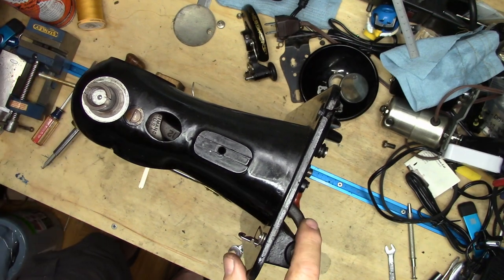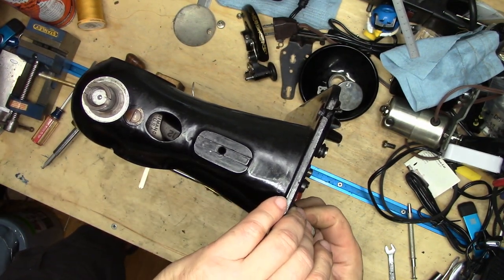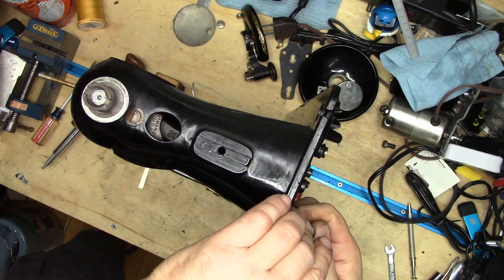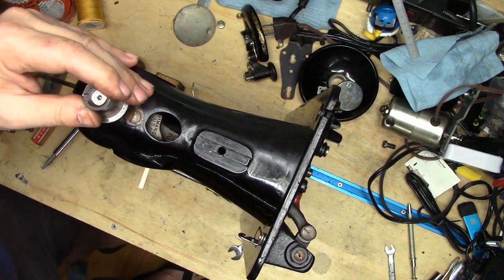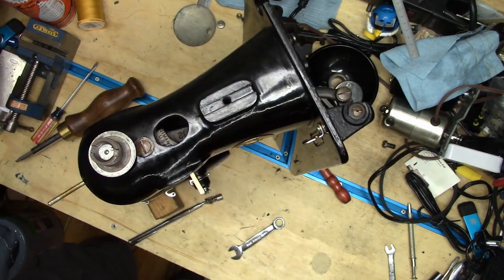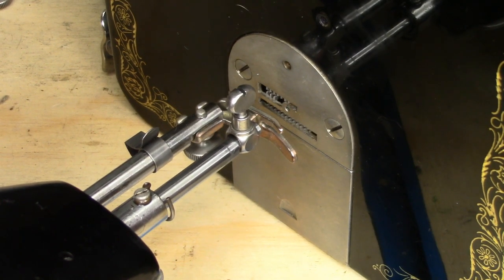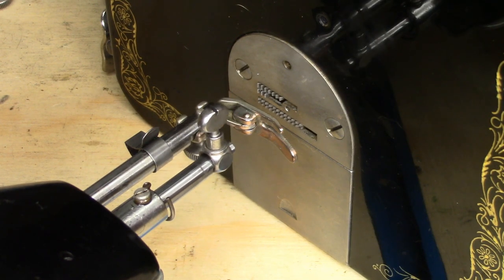All that's left is to make the normal adjustments for the fore and aft position of the feed dogs in the needle plate. I've covered that before but I'll cover it again so you don't have to go looking for it. With the feed dogs up all the way, put the nut back on the eccentric screw so it's loose. Let me swing this around and zoom in on the feed dog. No adjustments have been made yet — I'm turning the hand wheel in the direction it would normally be turned, with stitch length set to maximum.